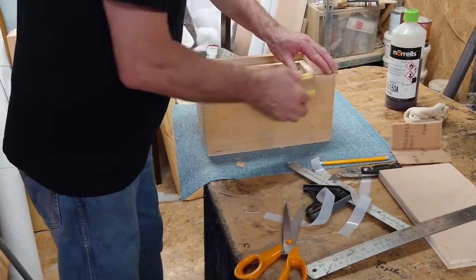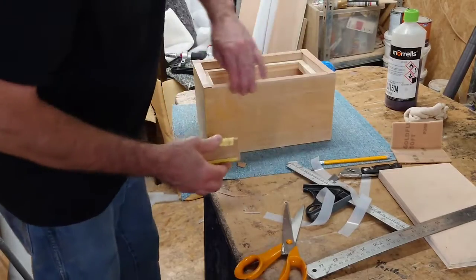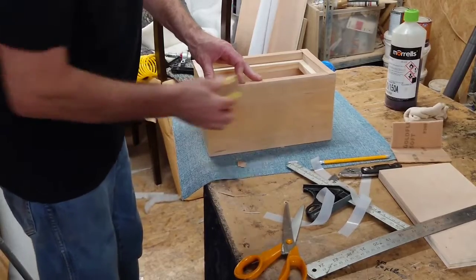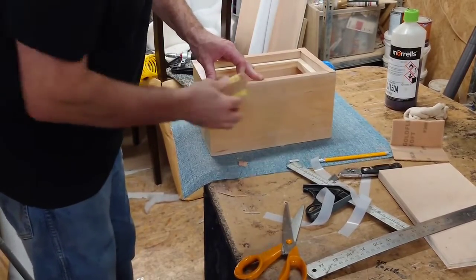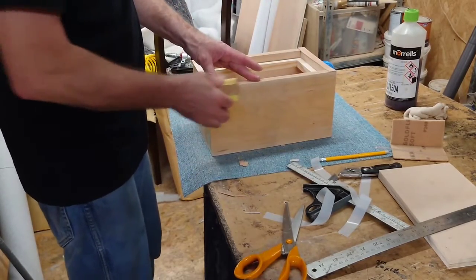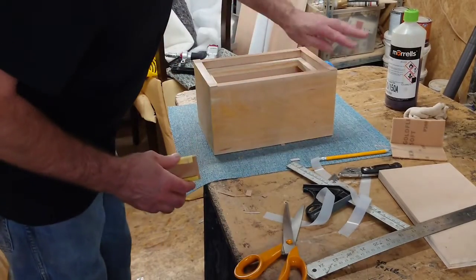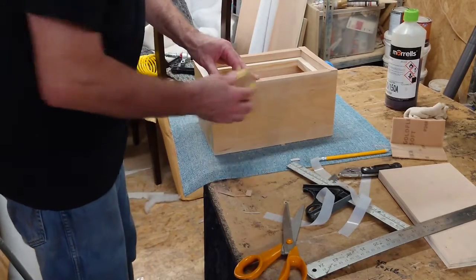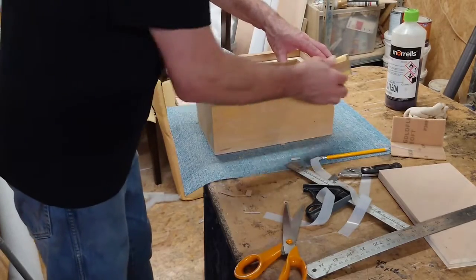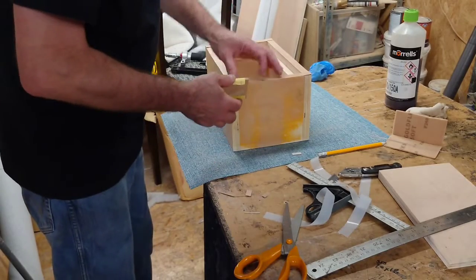And what I'm going to do after we've done the front is I'm just going to show you how to veneer one of the sides, and then I'm going to crack on and get it done, and then we'll start the polishing process. And what I've done is I've matched up the veneer all the way through, apart from the underneath. I'm not worried about the underneath, because matching the veneer there meant I needed to buy two lengths of veneer, which would have come out to £50 as opposed to £25. And as I don't see the underneath, I thought to myself, there's no point.